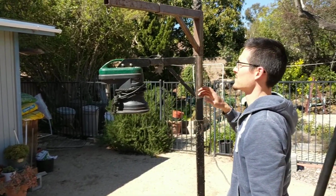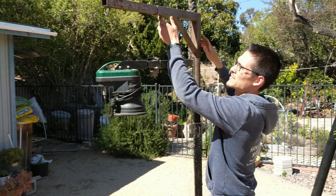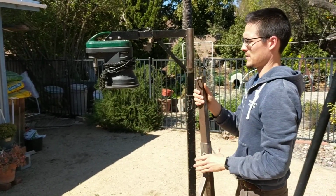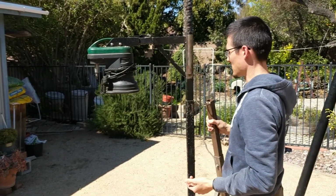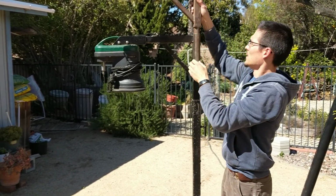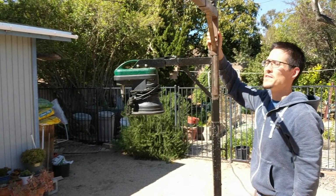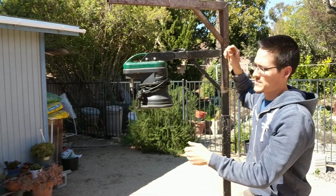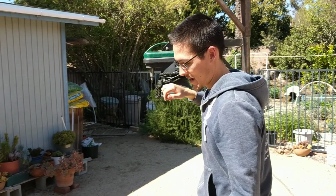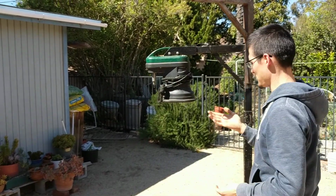I use it on really big jobs. On small jobs, I don't use it because it's just kind of a cost benefit of the time it takes to set it up. So if it's only a few sheep, it doesn't matter. But when you get into a big flock, then you're probably going to want to attach that. And the reason you do, again, the round tubing here is because as you shear, you move, and you want this to be able to move with you, so that you're not tugging on the top of the support here with your back aid as you're trying to reach a leg or do something else. So I'll just leave that up there so you can see what it looks like.